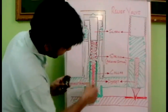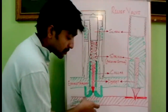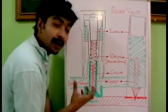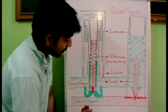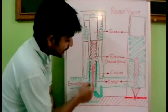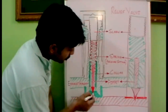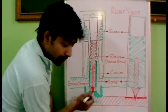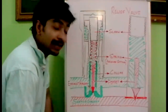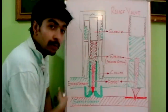We have a poppet which is connected to the service gallery. If 100 bar is the safety pressure, this poppet will be pressurized towards the gallery at a limit of 100 bar. When the pressure raises above 100 bar even slightly, the poppet will tend to open and the oil will escape through this area towards the exhaust gallery, which leads to the hydraulic tank.